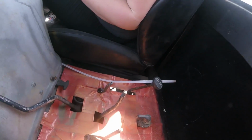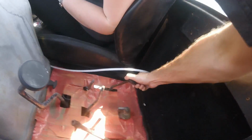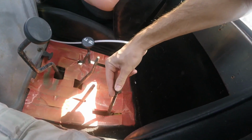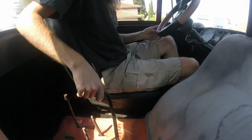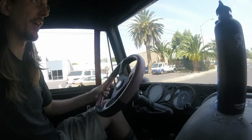Forwards: neutral, clutch in, Johnson bar forwards, crawler range, highway range, first or second gear. You're going to start in second to go forward. The gear rating is so low, you can skip right over third. You can go straight from second to fifth.